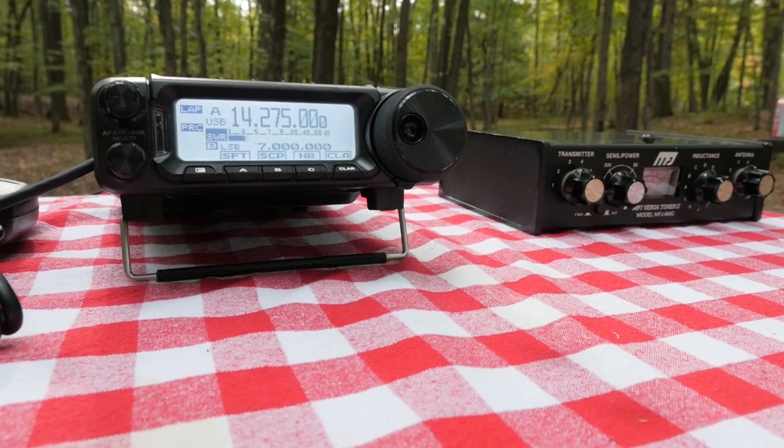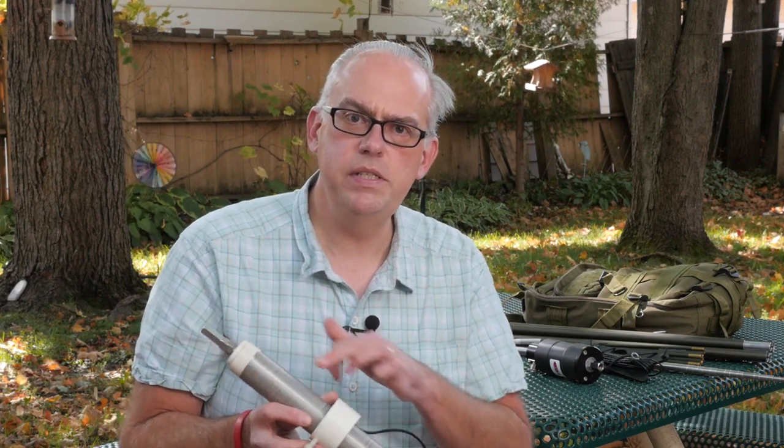The big advantage of the M-Pass is that across the HF band, the antenna has an SWR of about 2.5 to 1 or less. So if you're using an auto tuner or the built-in tuner on your rig, you can just hit that tune button and transmit. Even with a manual tuner like what I use in the field, the tuning process is relatively easy. That's not quite the case with the Silver Bullet. If you change bands, you're going to need to adjust the coil. You can speed this process up by running a piece of tape along the side and making some marks, but you're still manually fiddling with the antenna and may need to adjust the radials and the whip a bit to find that sweet spot.